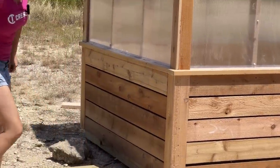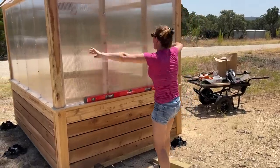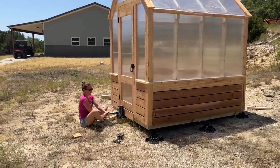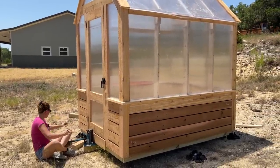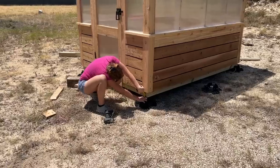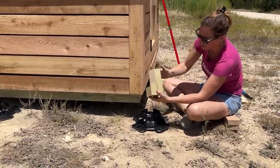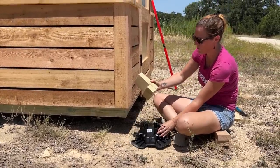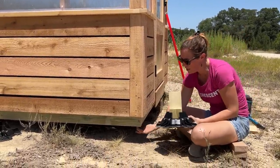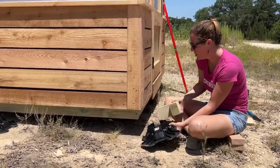After getting the high point set, I leveled its sister corner to it. Then I went to the opposite end of the building and jacked it up to level. I took measurements — two and three-eighths on the left, two and a half on the right — then cut the block with a shoulder. I'm going to slip it underneath the framing, pop it up, and set it into the four-by-four cubby of the tough block so the framing rests on the two-by-six, allowing me to run in screws and secure everything.